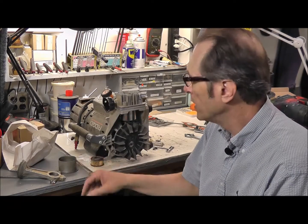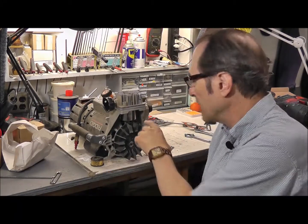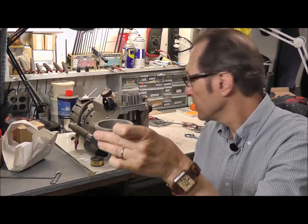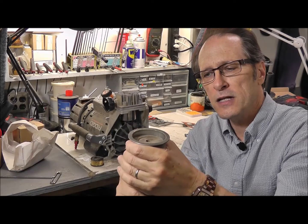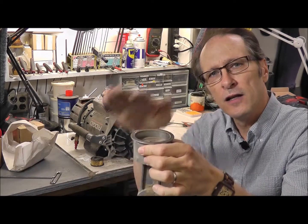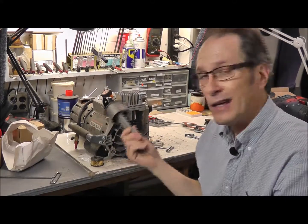So what have we learned? One: when you get your new piston cylinder kit, you're not going to take the cylinder and try to shove it down over top of the piston assembly. You're going to take off the connecting rod — it doesn't take that long. Put your cylinder inside the frame of the pump, take your piston assembly, pull it down through the cylinder, slide it down, shove it on the eccentric, tighten it down, valve plate assembly, gaskets, head — you're in good shape. This thing will run forever. Last thing: get a new air filter.